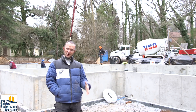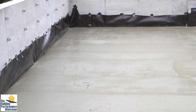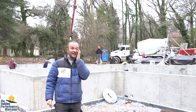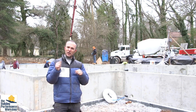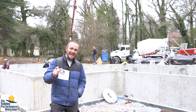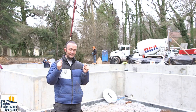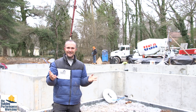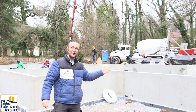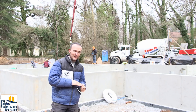We poured this morning. You know it's going to be a special day when you wake up after you're supposed to be awake, the sun is already well up, the first word out of your mouth is a swear word. You stumble through your 200 square foot house and out the door and see the boom truck already there waiting for you to move your pickup truck. So we scrambled to finish up all of the taping, because of course it's very cold out here. With the Pango Wrap system, the tape is not supposed to be used under 40 degrees — both the surface temperature of the concrete and the air temperature need to be 40 degrees or more. You could spend all your time with a heat gun and a space heater, but honestly you're not going to fight the weather very well. I was here last night until there was literally ice forming on the top of the Pango Wrap, and then we woke up this morning and worked with a slightly different tape that works down to zero degrees Fahrenheit. So that came in handy — that was really nice.